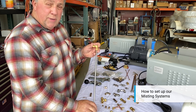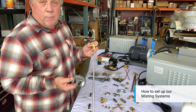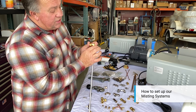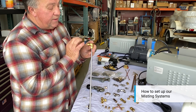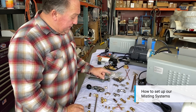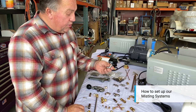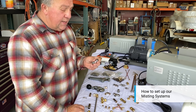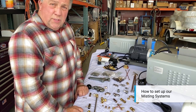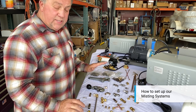You'll have elbows like this, which you just cut the steel with a good pipe cutter — I like Rigid, you can get them at Home Depot. Then put your stainless steel in, get your wrenches, tighten the crush sleeve, and you're good. Put your next piece of stainless steel on, measure it out, extend it, and so on. All your elbows, unions, and fittings are now stainless steel on all the kits. We give you anchors for stucco or wood screws, and all your color-coordinated clamps — everything comes with the kit.